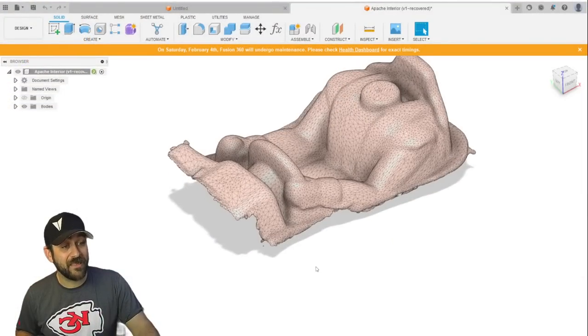Is this the free version of Fusion 360? No, I pay for a version of it because I use it for my CNC. If you use the free version for the CNC, it takes away things like rapid tool moves. I don't want my CNC to just be moving at the normal cutting speed in between everything. I want it to come up and go fast over and then go back down. And I use it so much and I didn't want the active file limit. So I pay for a normal version. I think my subscription just renewed. I think it was like $485 for the year.